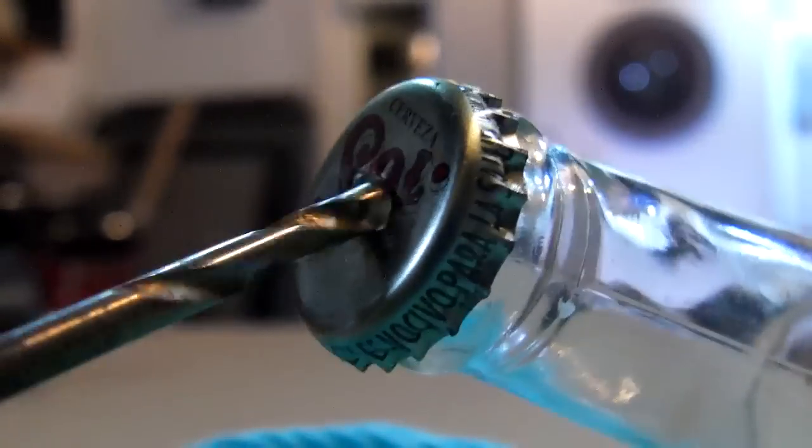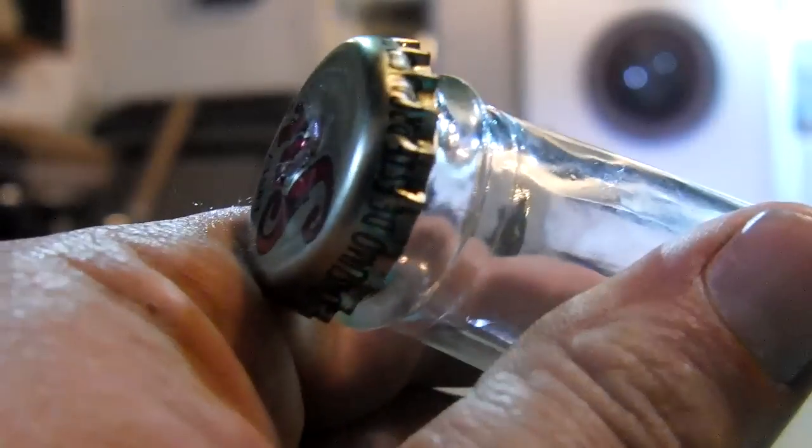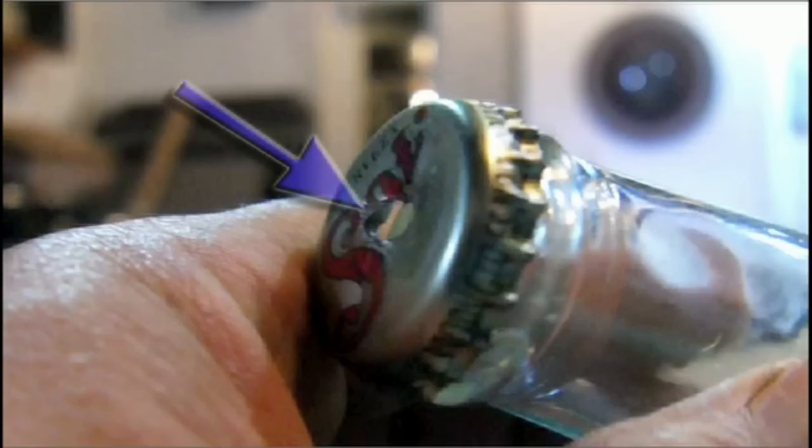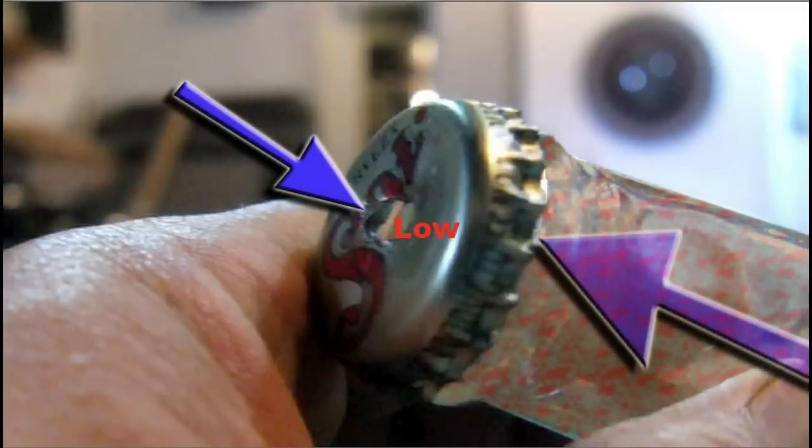After drilling a small hole, simply bend the metal or plastic so that one side is dented in and one side is formed outward to create our small valve. When a velocity of air or water is directed over the raised lip, low pressure forms at the opening, expelling the contents in the vessel and resulting in a vacuum.